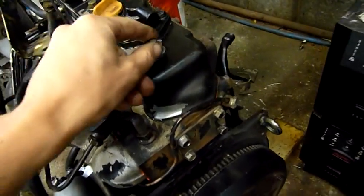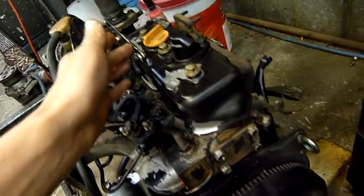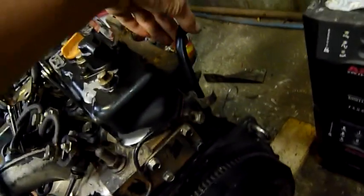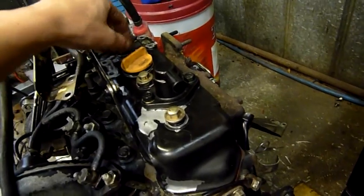So first steps: take off any ancillary equipment from the rocker cover. Take the nuts off the top, disconnect your decompression linkage if it has it, disconnect your crankcase breather hose — make sure it's not kinked like this one is, I might replace it. Whatever other brackets there were — there was another bracket on the side for the radiator overflow pickup bottle. So yeah, you've got to strip all that stuff aside and try and get the rocker cover out. It's a lot harder once it's in the tractor, although if you lift the cowling up it's pretty easy.